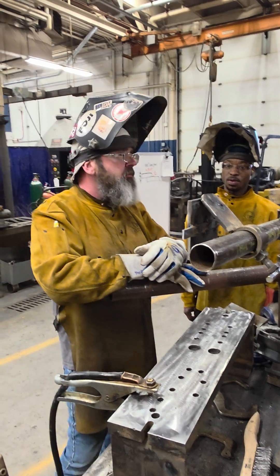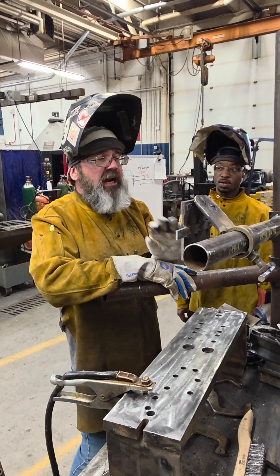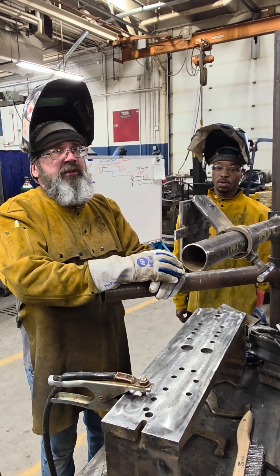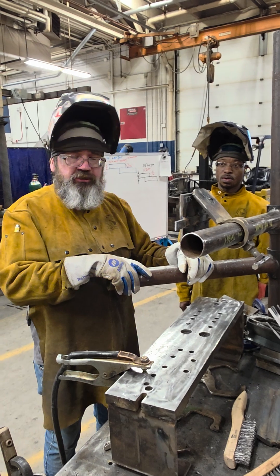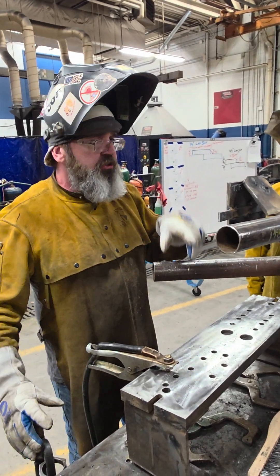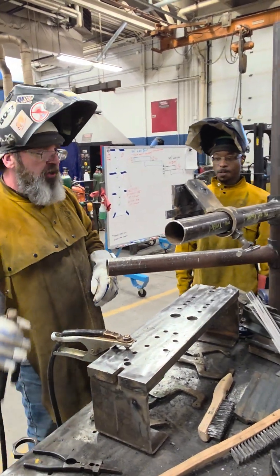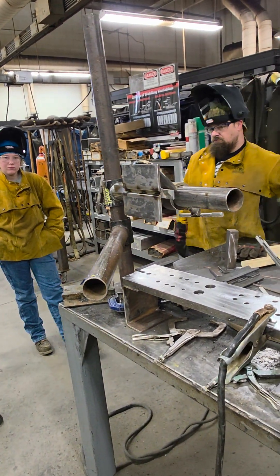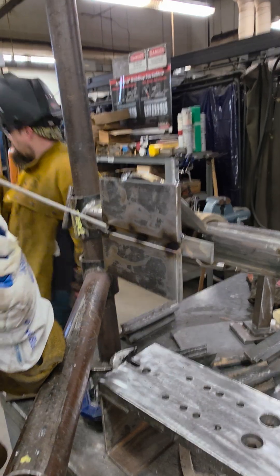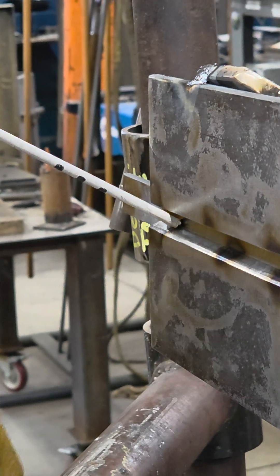Do not flip the part. You can take it off to clean it, but then you've got to have me verify that it's back in the same position. I just leave it up here and clean it. Do not quench it. For the first pass, all you're doing is welding that bottom plate to the backing strip. Come in here and bring it up so the rod is centered an equal amount on the backing strip and the plate — about 30 degrees, 15 to 20 is usually enough.